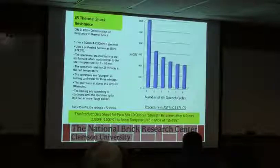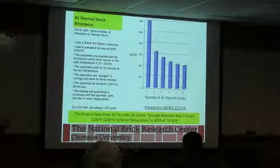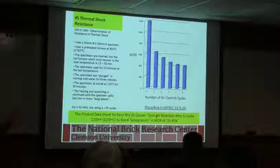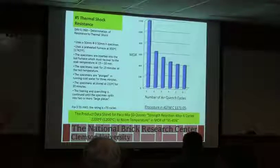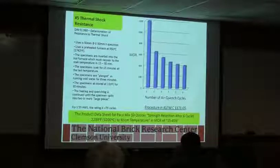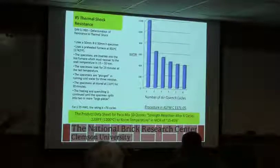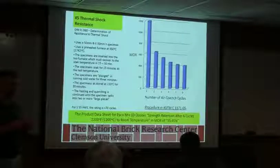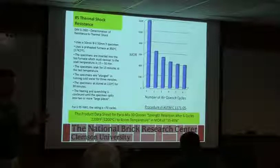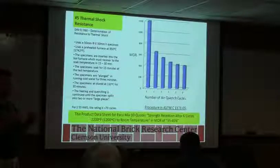However, one of the things you have to think about, if your car is below deck fired, when it goes past that first burner, it's going to get a surprise. So you need to make sure that the thermal shock resistance of the product that you're putting in those locations is robust enough, because again, when it grows and shrinks, not necessarily everything, just like in your brick, is growing at the same rate, to where the temperature has to get into the center.